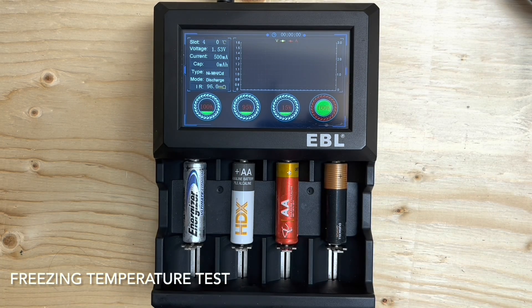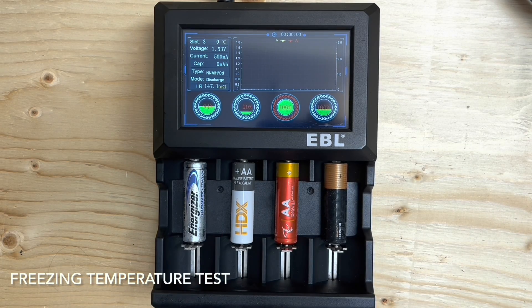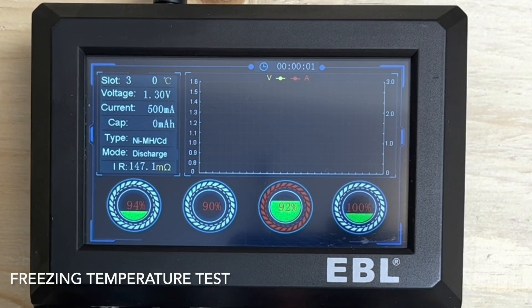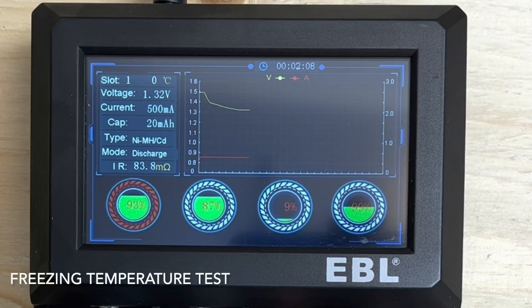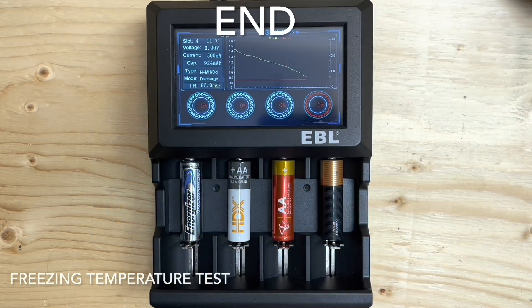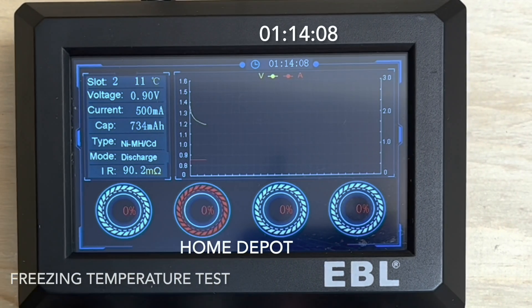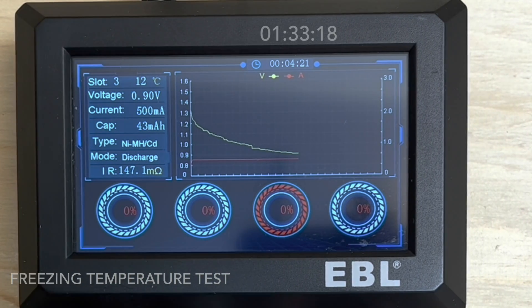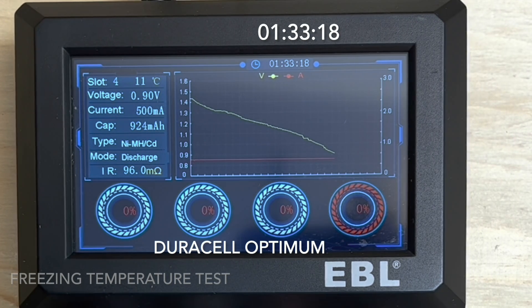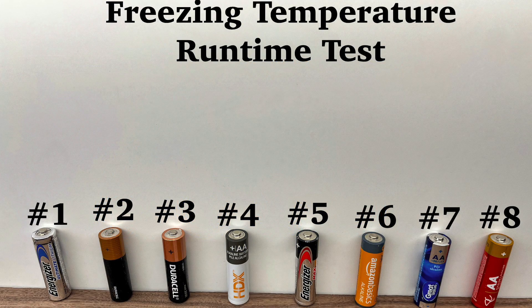With the last four batteries in, the PC battery capacity dropped straight to 15%. To make sure it wasn't the reader, I reinserted the battery, but the cold destroyed the capacity and it quickly dropped back off, as did some of the other batteries — just not as extreme. Only 2 minutes into the test, the PC battery had already dropped to 8%. Jumping to the end for results: the Lithium ran for 5 hours, 52 minutes and 41 seconds. The Home Depot did well at 1 hour, 14 minutes and 8 seconds. The PC only ran for 4 minutes and 21 seconds. The Duracell Optimum did 1 hour, 33 minutes and 18 seconds. For strictly run time, no surprise — the Lithium in the cold came out ahead.